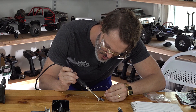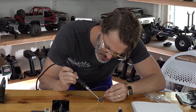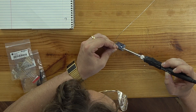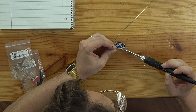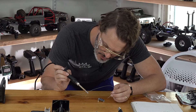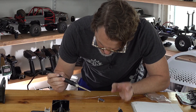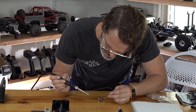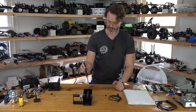Maybe you don't want to use a big beefy tip like I'm doing — it's not the easiest job, but once you get into a good rhythm with it, it's not so bad. I caught a little cold solder joint, so we'll fix that one up, and the rest of them look good.